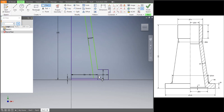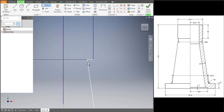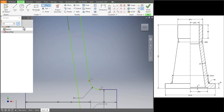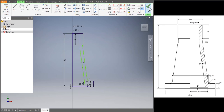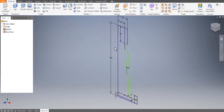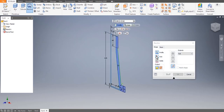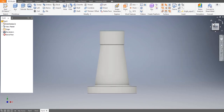Fillet would be 1 — click on those two lines. Then these two lines. Now we have to fillet the other part which has a radius of 8 — click on those two lines. Now the part is ready. Finish Sketch and we revolve it to get the 3D view. Choose the section, choose the axis, click OK — there goes the body.